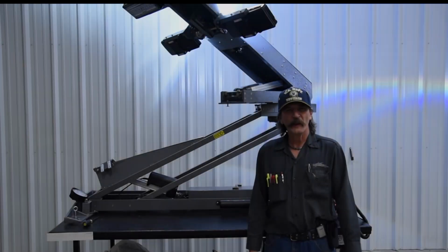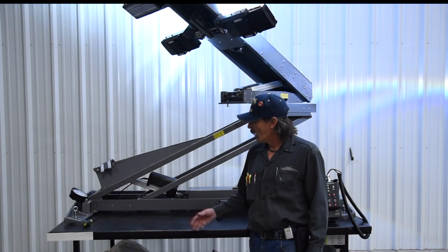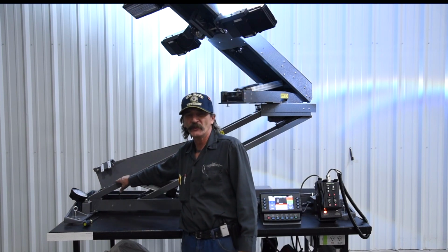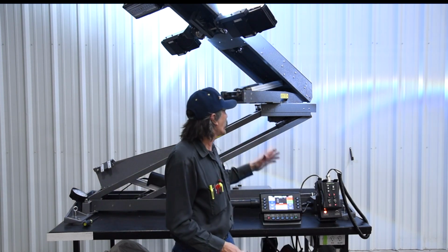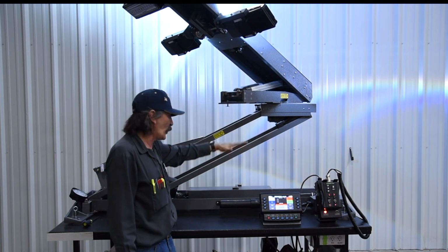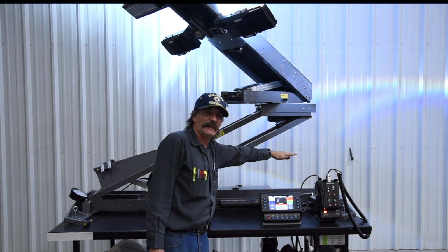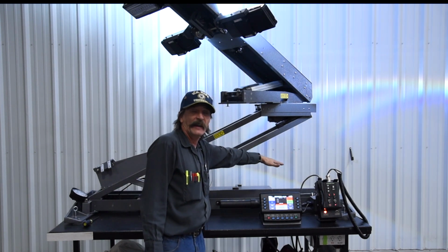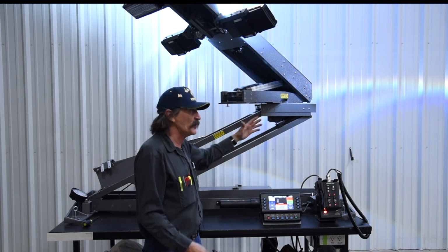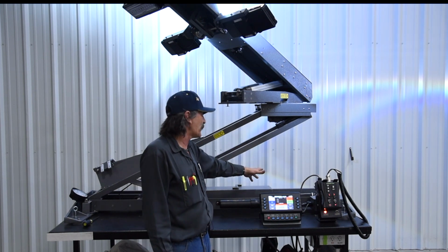Another feature that is incorporated in the command light is what's known as our safety limit. It's basically a mercury switch that is adjustable. It will not allow rotation of the lamp tree or the lights to come on below a preset level. At the factory, we set it about 12 to 15 inches up out of the base. Anywhere above there, you'll have full operation. Anywhere below there, you will not be able to rotate and your lights will go back out.